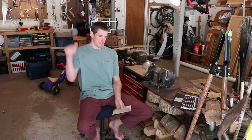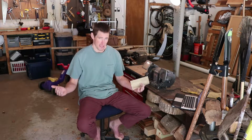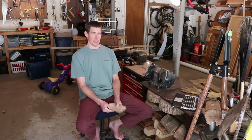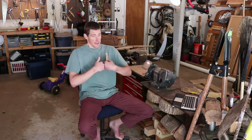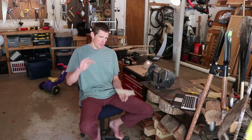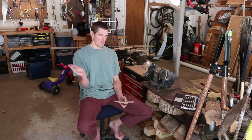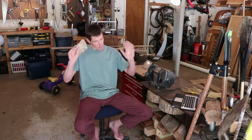Here, as I said in the first video, I don't care about the blade being that sharp. What I care about is just that it's aerodynamic and in decent shape. I could make the blade sharp. I could shave with that lawnmower blade if I wanted to. But with all the grass and sand and rocks and roots that the blade is hitting, it doesn't make sense to make the blade razor sharp. In fact, I could see that as a bad thing to do. But you do want to get rid of the burr.